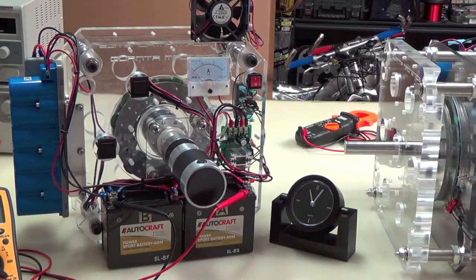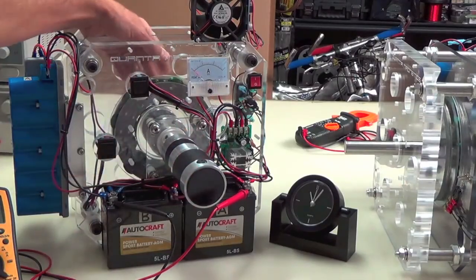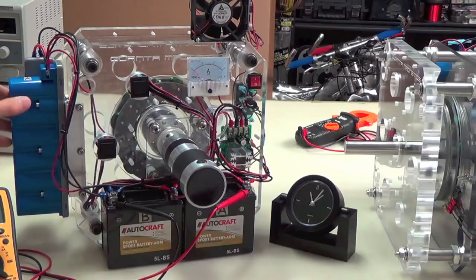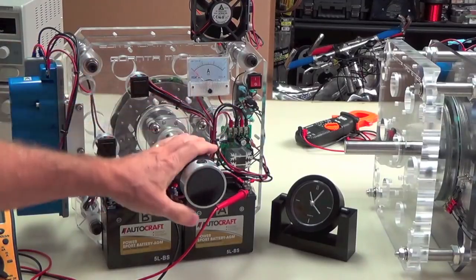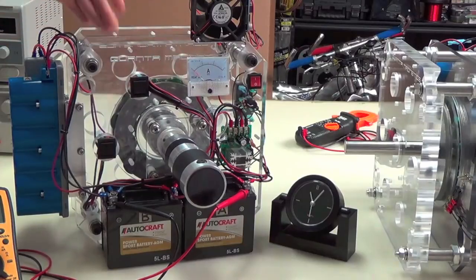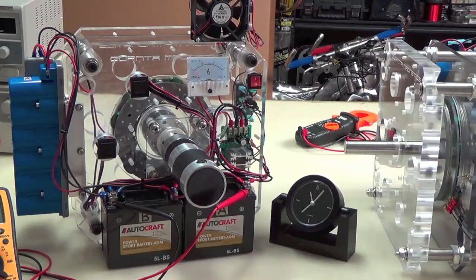So beginning, what we've got is, again, this motor, and the three phase, 2 AGM batteries here, 2 ultra capacitor modules here and here. There's 350 farads in each one of these 6 sections of each one of the modules. And I've got a pulse width modulator circuit, just a simple little circuit that keeps this within its range. It's a 12 volt DC motor. And I've got 3 bridge rectifiers that convert the AC off the three phase back into DC that feeds back into the system.